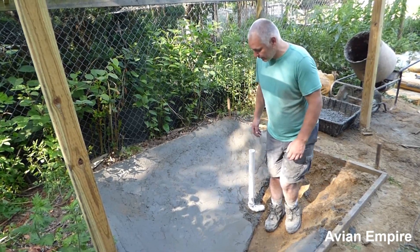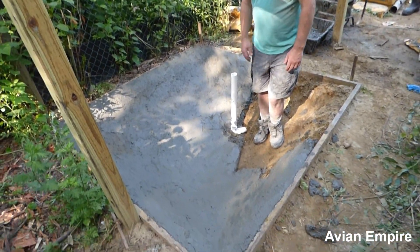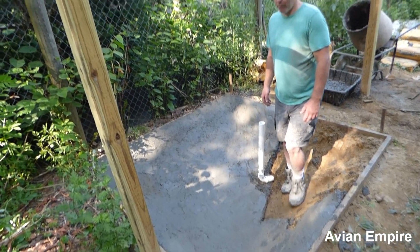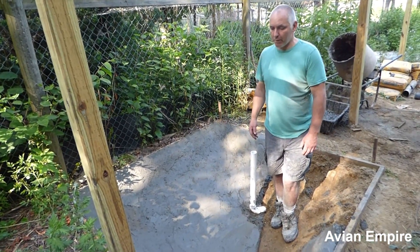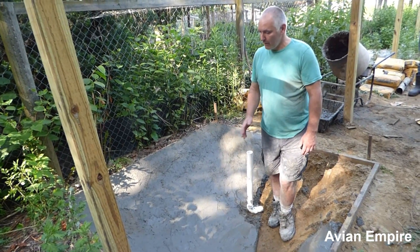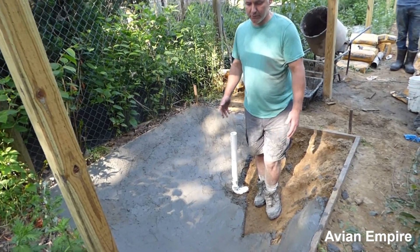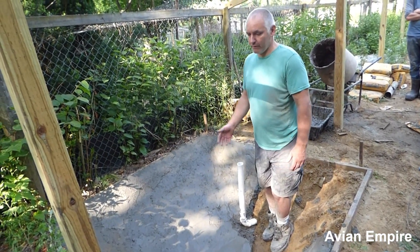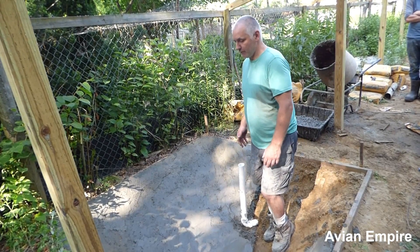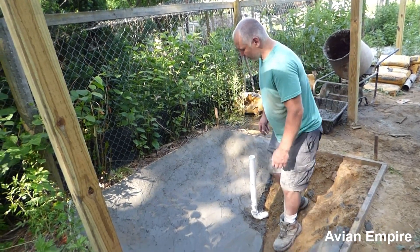So this pond — we're going to go another layer of concrete over the top of it. When we're done there may be a few holes, and we'll end up using Type S masonry cement to patch it up. If these ponds do leak a little bit, it's usually not a big ordeal. If they leak just a little bit, you can actually live with it because you're going to be putting water in it on a regular basis anyway.